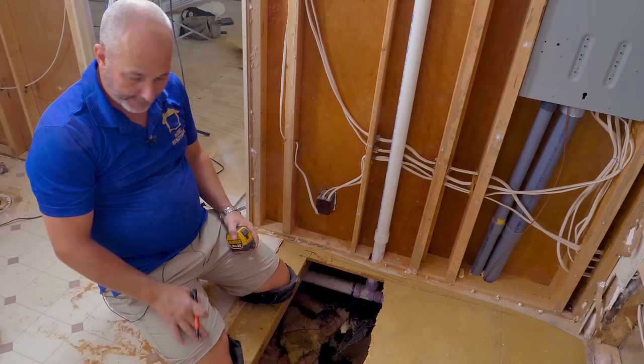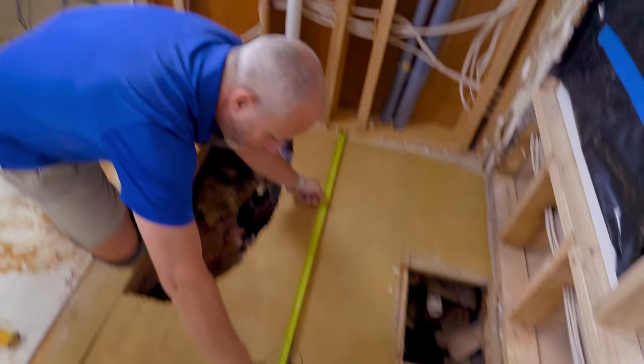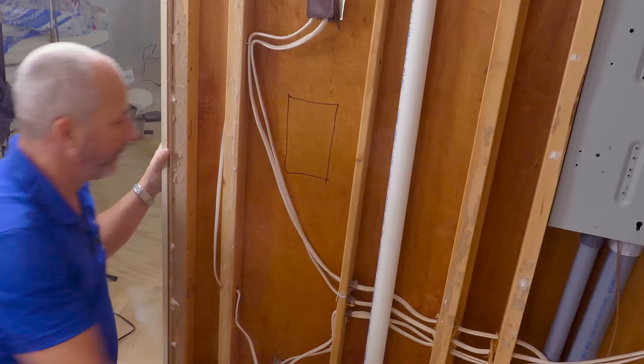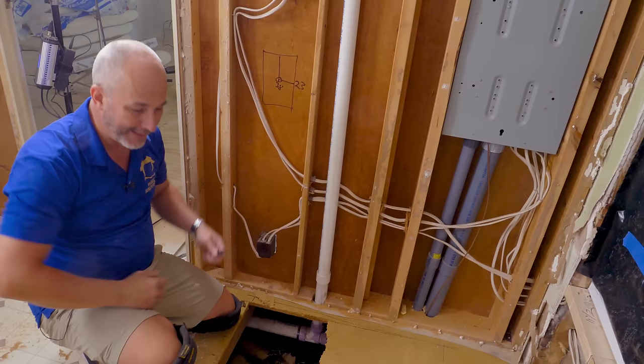I'm thinking about building a custom cabinet, but that's fine — lots of room. Let's make sure our drain hits this spot right here. From the wall it's going to be 38 inches, and 23 inches the other direction. We're going to write that down as a little template right on my wall: 38 and 23 — that's where we're going to put our p-trap. Now it's just a matter of ripping up the subfloor, cutting the plumbing, adding some pipe, running it over, throwing on a p-trap, cutting the plywood, and reinstating. We're basically prepped and ready to roll.